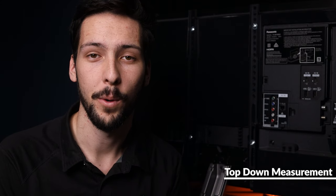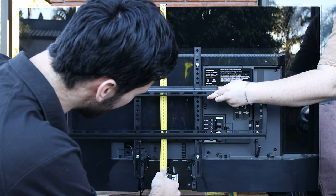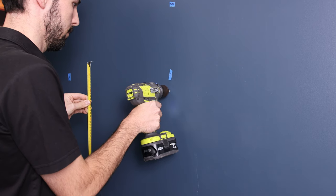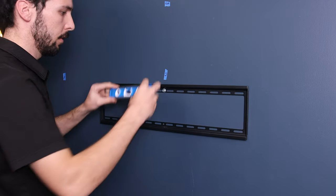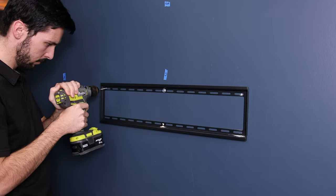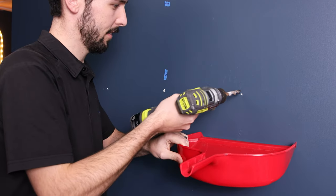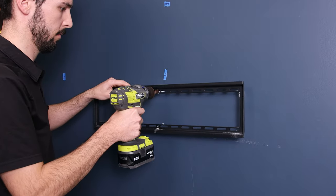To figure out the point where we're going to make our first hole, we need to take a measurement from the top of the TV to the top hole of the bracket. To get an accurate measurement, put the tape measure behind the plate and look through the hole so you can see what the measurement is. Use the top-down mark and drill our first pilot hole — use a 3mm drill bit first as we just want to make sure there's actually a stud there. If you have a friend to hold the bracket that's helpful, otherwise just put the screw through the bracket and start screwing it in. Use your level to make the bracket straight and make sure it's over the other stud. Drill pilot holes for the other three screws and screw them in. If you need to use jib locks, make pilot holes anyway as you might find there's actually a stud behind there. Jib locks or snap toggles require a 13mm hole size — use the bracket box or dustpan to catch all the debris, it'll save your vacuum cleaner filter. Now fit the snap toggles or jib locks and screw the bracket back onto the wall.